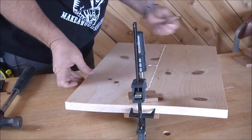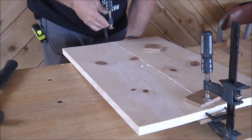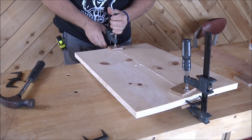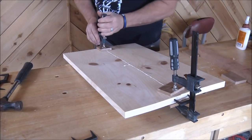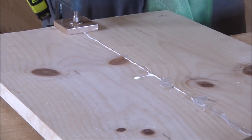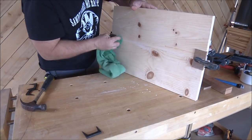This is the same thing that I do when I'm doing regular clamps — my bar clamps. That's a rooster — yeah, it must be morning. Anyway, that's it. You can see that's a pretty good joint there. You've got plenty of squeeze-out going on there, which you want. The cool thing about this glue, of course you guys know, it cleans up pretty easy with a damp cloth. That makes actually a pretty nice little board.